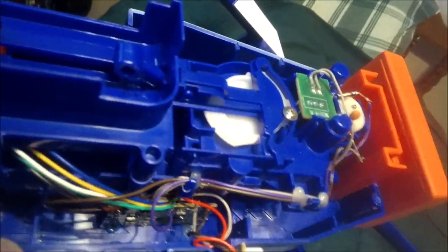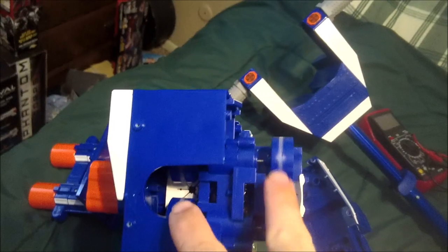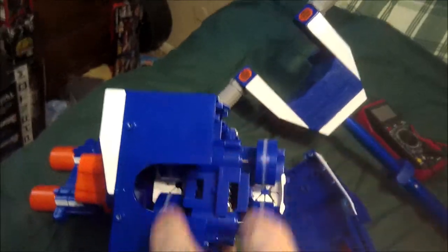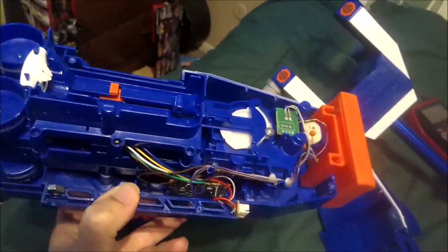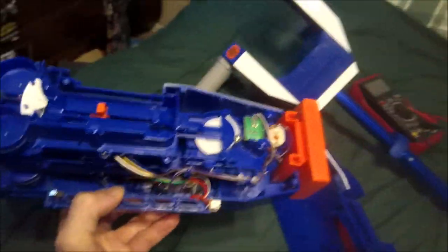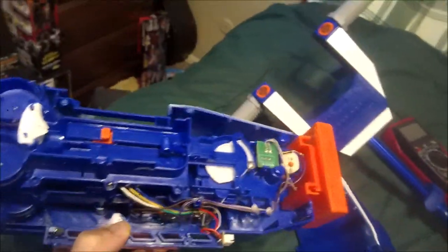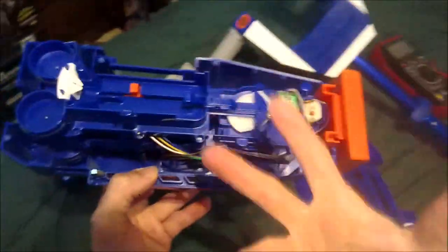That is also one of the things that I'm going to have to deal with, because if I'm doing new flywheel motors and everything else, my cage is replacing this funny thing with two sets of motors. So that's a lot of amperage, and there's no way it's going to handle that. So I'm going to be converting that purely to signaling. It's the switches in the back still, for all the proper signaling to tell it to turn on and off, but when it says, hey, it's time to turn this set of motors on, it's just going to run through an opto-isolator.